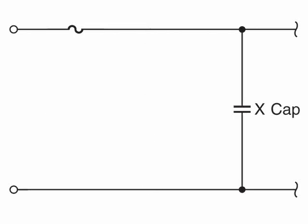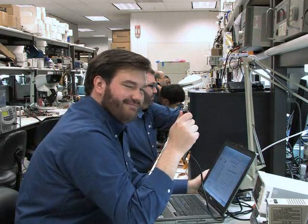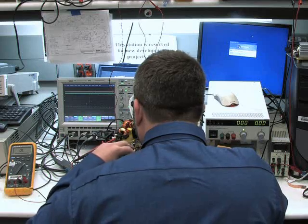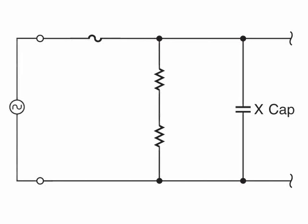Without discharge resistors, energy stored on the X capacitor would be present across the input prongs of the power converter and could shock the consumer after unplugging the supply. But these resistors produce a constant power loss while the AC is connected and are a significant contributor to the overall no-load input power losses.